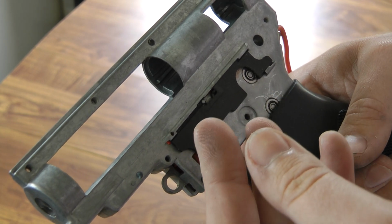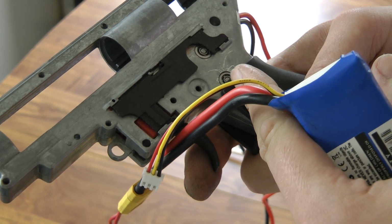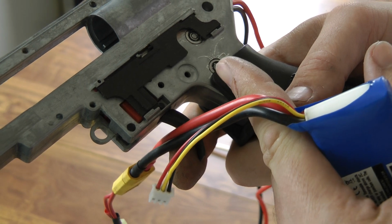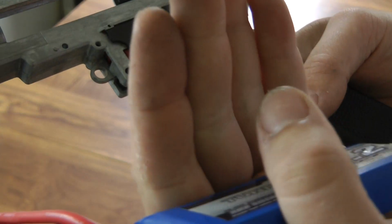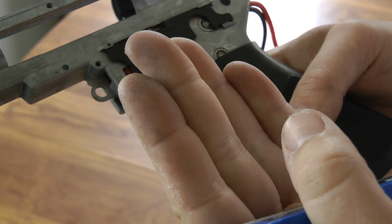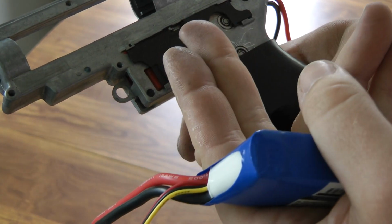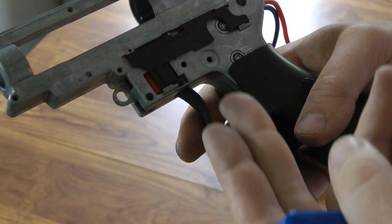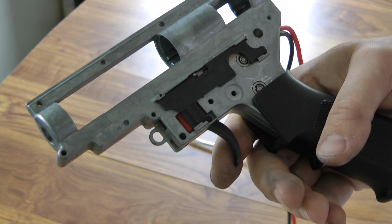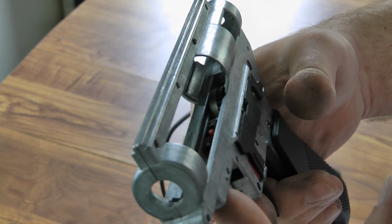potentially push against the actual casing, and not all casings have the holes in exactly the right position, top and bottom, so they bind up. Sometimes they'll be at a slight angle, and that's then going to affect the gears. So you then might potentially have to shim the gear up slightly higher, or potentially take off some material from the casing. So you've got all these factors that are separate on top of shimming. There are all kinds of things you can look for, and this is just something you can do.